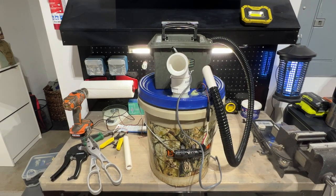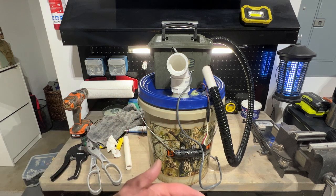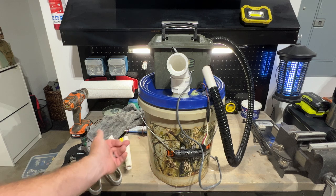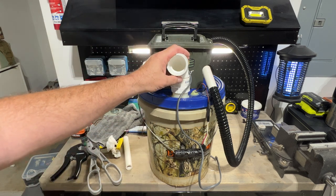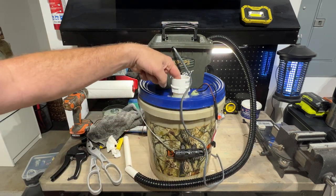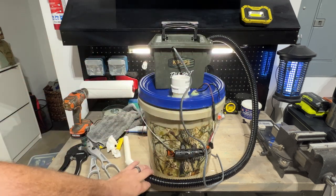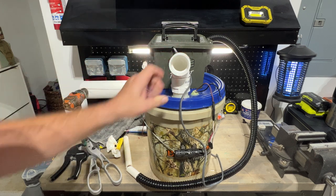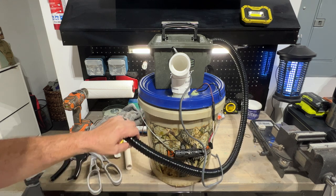There it is, guys, bucket dredge. Pulling material, getting into small streams and creeks, being able to suck up all that material and fill buckets up with it, and then run that through a sluice or through the little high banker, and just be able to swap out the power unit, swap it around. I have this elbow, but it is not mounted, so I can just pull it off and purge the water. Once you fill the bucket up as much as you can, you throw water in here to purge out the hose. Keep this in the water so you don't have any air pockets in there. And I just use this to kick it out. Turn it on, suck up material right off the bedrock, right out of the cracks, a little bucket dredge.